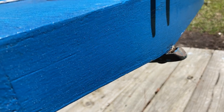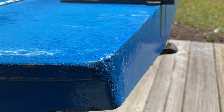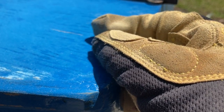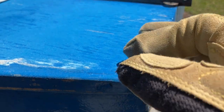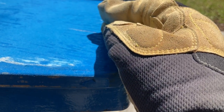I wanna talk real quick about on the back here, these decks are made from fir plywood. You might be able to see the seam. It's about 1/4 inch thick. And when you get to be almost 60 years old, you start to get what's called checking in the top. This veneer of wood is actually spread apart a bit. So there's probably 3 to 5 veneers of wood in here with glue in between. So when that spreads, that means moisture could get down in there, create more of the same type of thing.